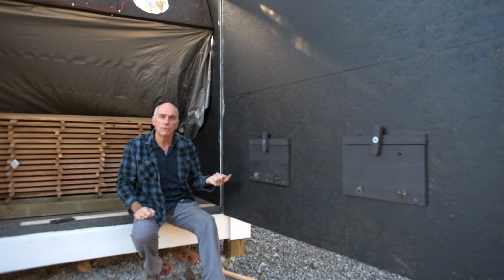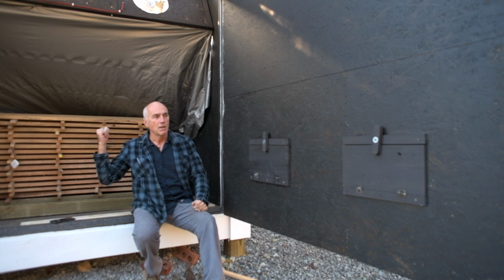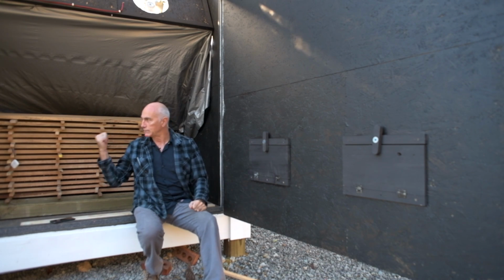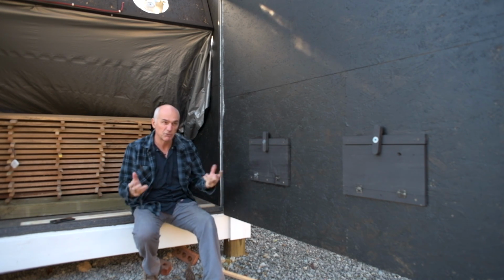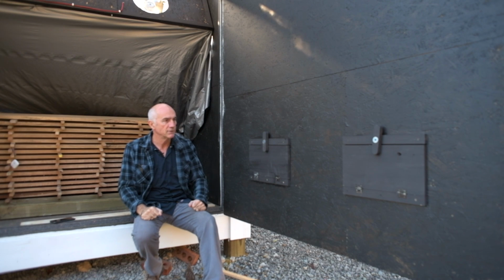I took out the load of lumber I had in there last week, or a couple weeks ago. I had 8/4 material, or 2 inches thick, and I didn't think with the time left of warm weather this year I was going to be able to get it dry, because it was only dropping about 2% a week. And so I took it out. There was some maple that was nice and dry. But I went to my barn and I got a bunch of 4/4 material that was pretty dry. So I'm just finishing that off, and it appears it'll be done here in the next couple of days.